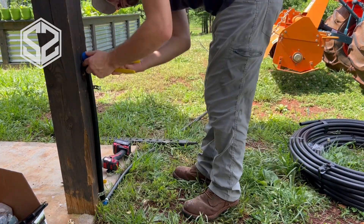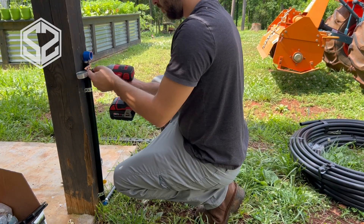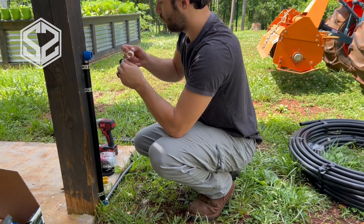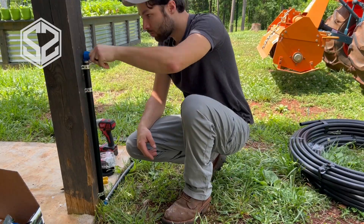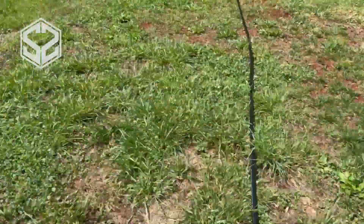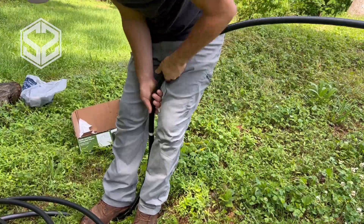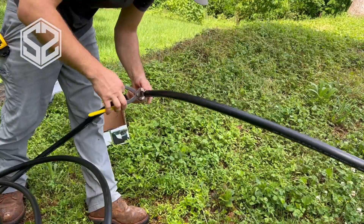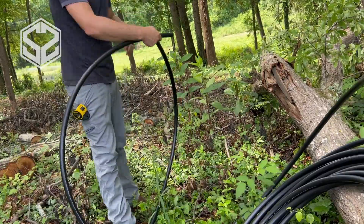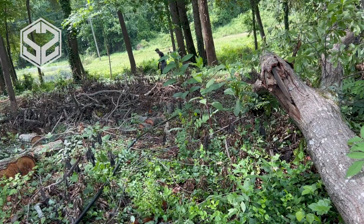To get started, I have about 400 feet of underground water line that I'm going to run across the top of the ground for now so I can hook everything up as a proof of concept — make sure everything works before renting a trencher and burying this line about a foot into the ground all the way through the woods. These fittings and hoses are pretty easy to install. It's hard plastic so it won't compress when buried underground; you just put the fittings in and they have rings that clamp down to seal it. When I purchased these hoses there were two different grades — one had a much higher PSI rating, but since this is just gravity-feeding, the cheaper lower PSI rating was perfectly fine.